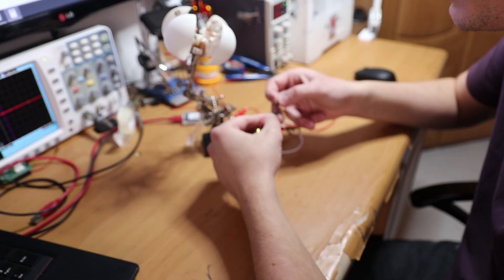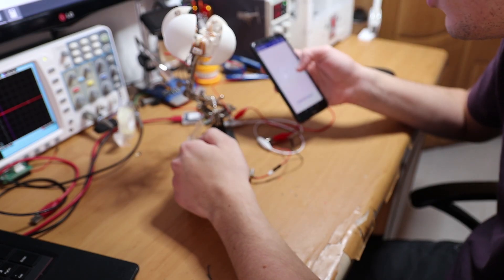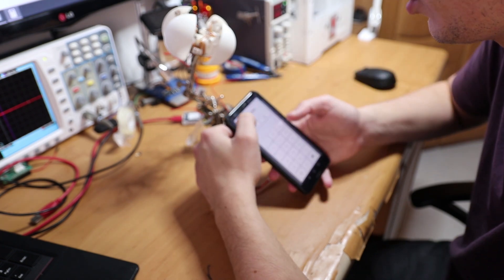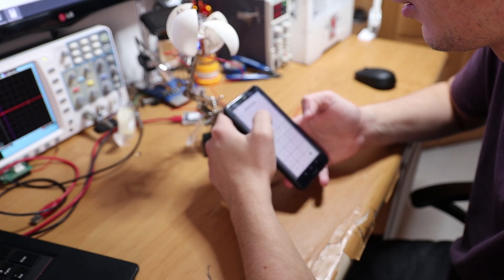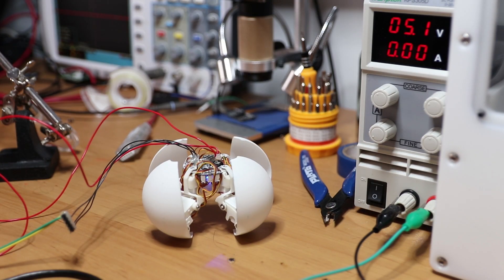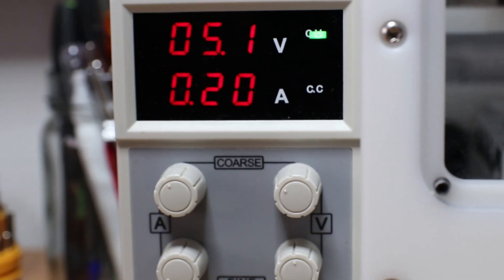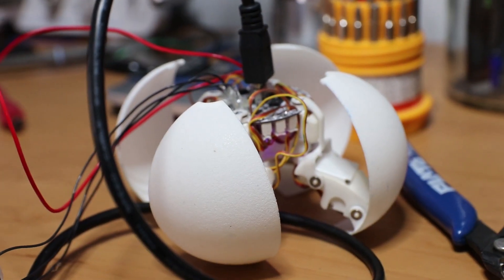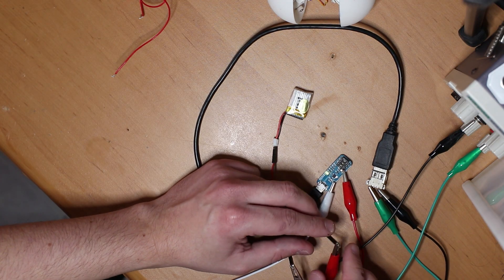Let's first try to power the robot with it. It seems to be connected, but I think we need to charge it. The battery seems to be charging, but the servos are still being powered — the charge current is still larger than what it's consuming in this mode. This means the battery is going to take forever to charge up, so I'm simply going to bypass the battery charger I designed on this PCB and charge the battery externally.